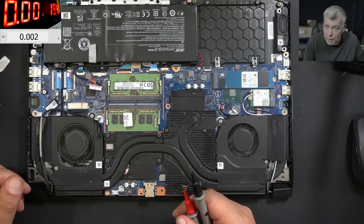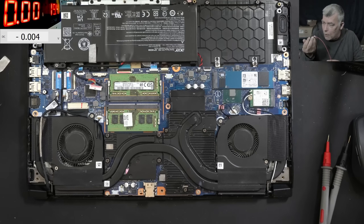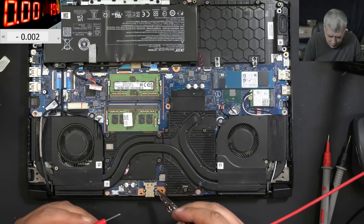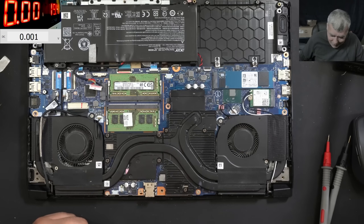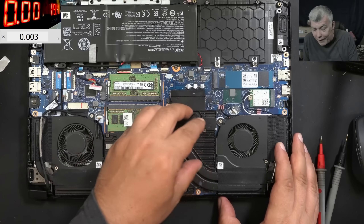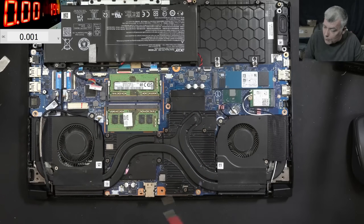Let's use the hardware. We can go totally maverick. I'll come with the power supply — ground here and plus here on the main power rail. It's not short, it's taking like 10 milliamps. So basically we don't have voltage not because we have low resistance on the main power rail, but because the input circuit is not doing the job.